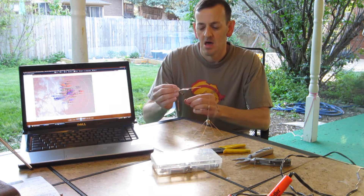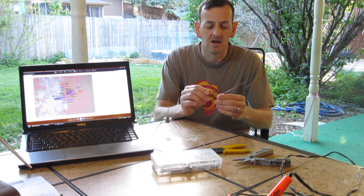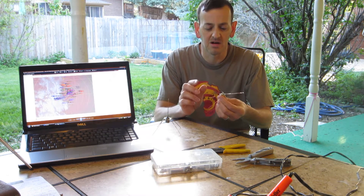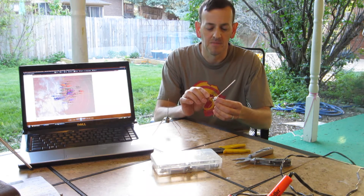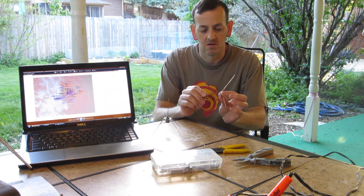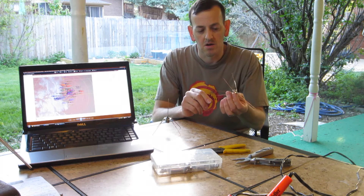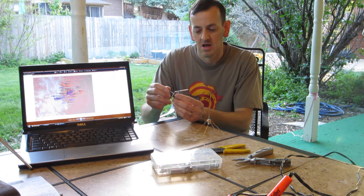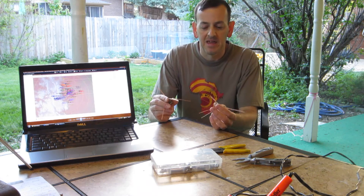This one's going to use some 12 gauge wire, and the other one is a lot lighter weight — using some thicker wire for the top, 12 or 14 gauge up here, and some 20 gauge wire here with very little soldering. The rest of it is just screwed onto the threaded F connector, which is convenient if you like to use F connectors for your coax. The SO-239 connector will also get the job done. Great for experimenting with some ADS-B.